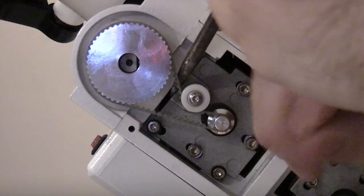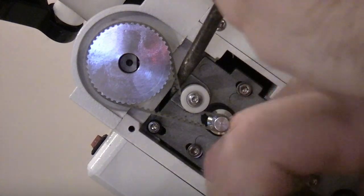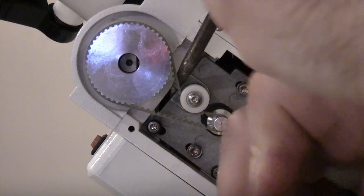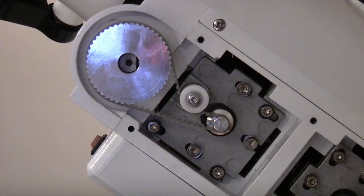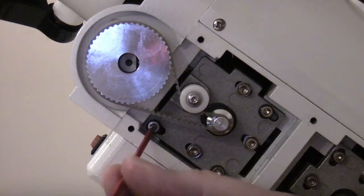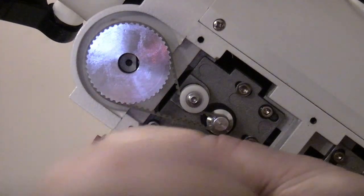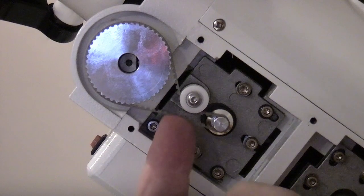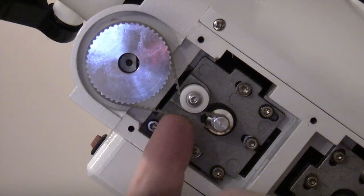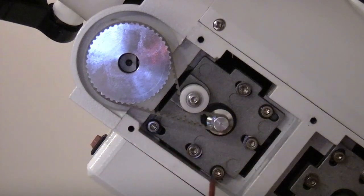And then just partly tighten the three screws to just hold it in place, and we can then test the tension to see if we're happy with that. Just a little push to the last screw. And just a little push with your finger to see how much this part of the belt deflects. And I decided it was just a little bit tighter than I wanted here. So just loosening those three screws off slightly,